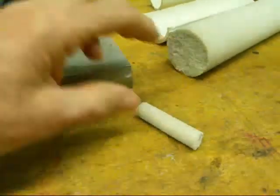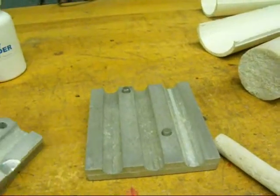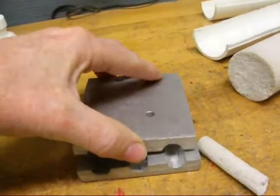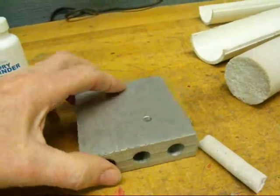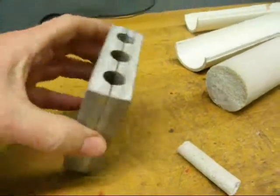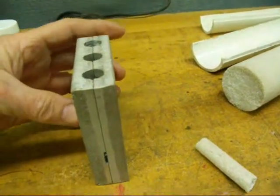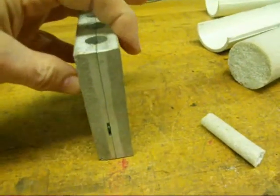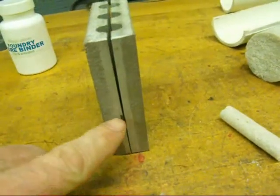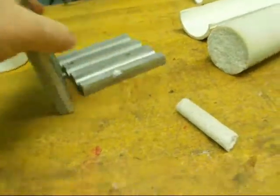This core was made in a metal core box. We can make three in there at a time and as you can see we've got alignment pins. This is an aluminum core box, so the core can be baked or gassed. Put a C-clamp on there and I usually put it in the kitchen oven — no odor involved — 15 minutes at 350 and it's hard. Then it can be separated using these little slots on each side with a screwdriver and you can pop it open and remove the cores.